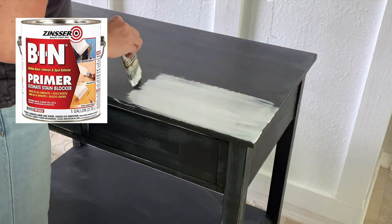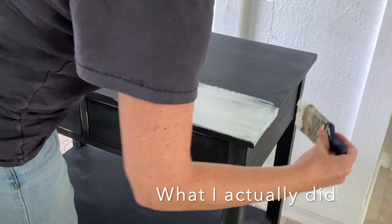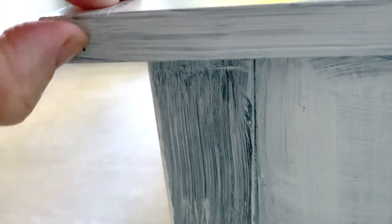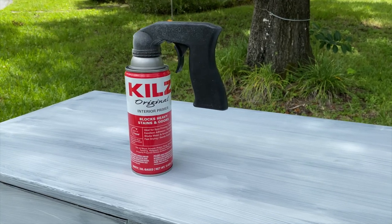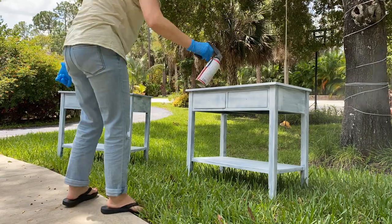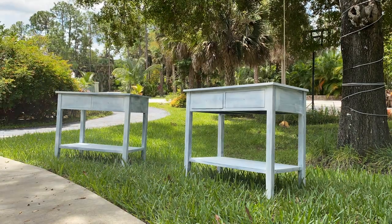What I actually did is I went ahead and used the water-based bonding primer I already had, gave it the old fingernail scratch test to see if it would hold up, and it failed. So I went to Home Depot and looked for the shellac primer that I should have used in the first place, and they were wiped out. All I could do was find a spray paint can of oil-based primer, so I went with it. Then I sprayed and it left a weird texture and residue, so I had to sand that down with the sanding block and carried on.